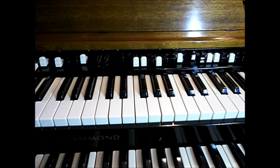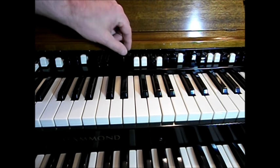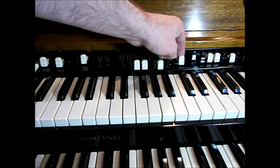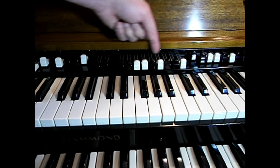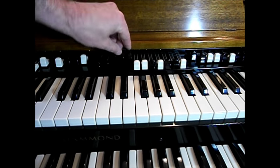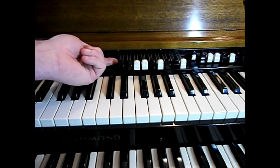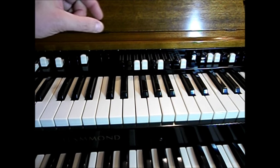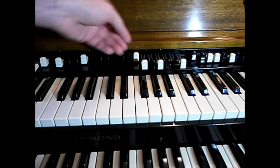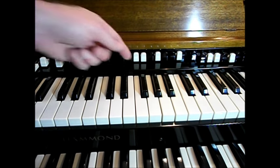Now cleaning the drawbar surfaces — we did the same thing. These tips are plastic so you can go through and clean all of them. Be careful going in between the drawbar shafts. There's a lot of oil and gunk that builds up underneath these tabs and you can't get in there easily. I took a fine rag on the end of a narrow plastic putty knife and was able to slide that in there, slash it around, push it in, slide it to the next section, and clean it up really nicely — you want to get this black surface as clean as possible.